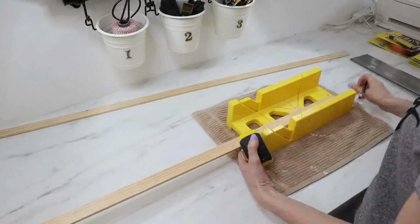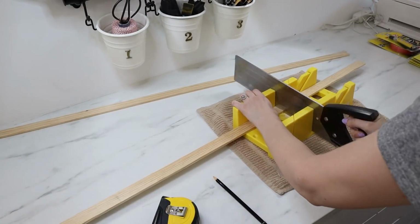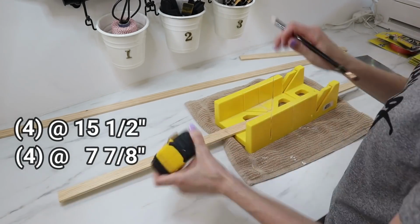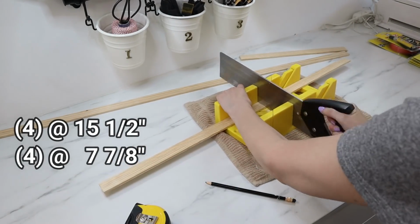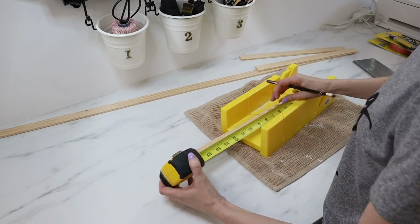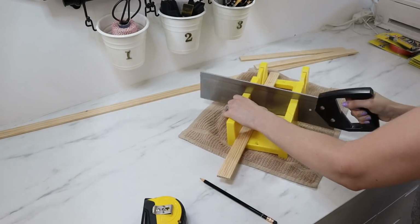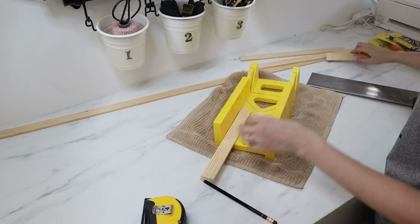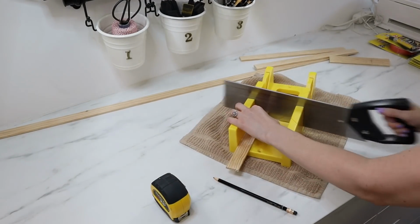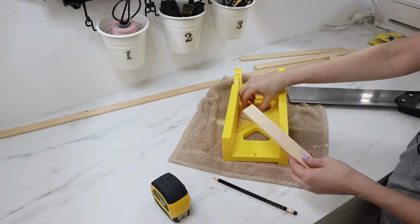Now we are going to have to cut down the other 2 4-foot long sections of lattice. You will need 4 at 15 1/2 inches, and you will need 4 cut down to 7 7/8 inches. I am using a handsaw and miter box to cut down my lattice pieces. It's really super easy and simple to use. I will link the one that I use in the description box. You can find them on Amazon for under $15.